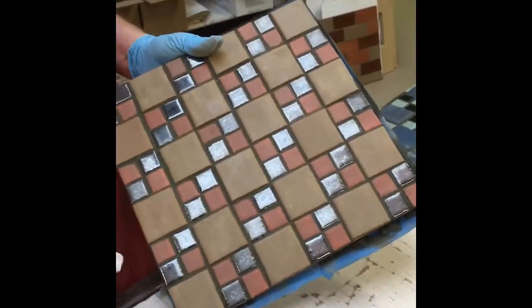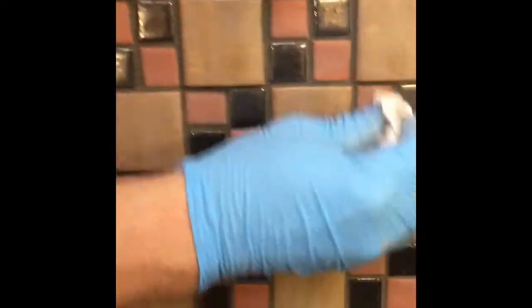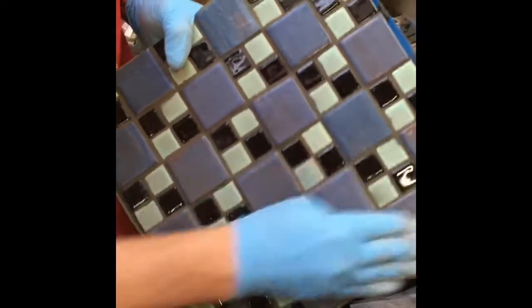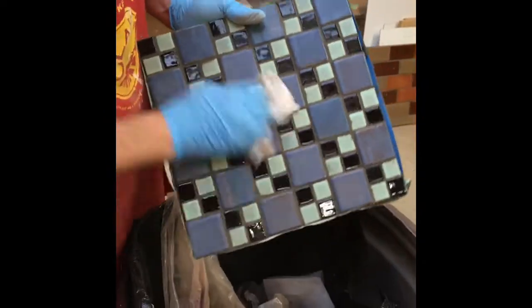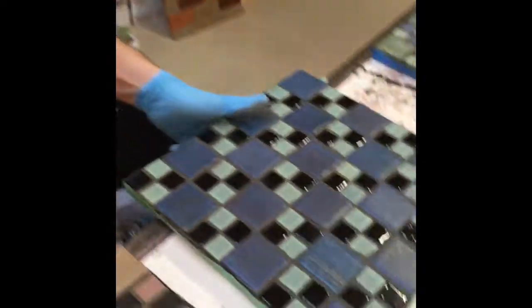Now that I've finished the grouting process, there's a hazing effect, so I'm going to start cleaning it out. You can see some of that dust coming off. The glossy ones are a lot easier to clean than the matte ones. It just gets more and more beautiful as we go, and we get all those colors to come through without the hazing effect. We just keep doing passes until we get to where we want — it usually takes about three or four passes before we're there.